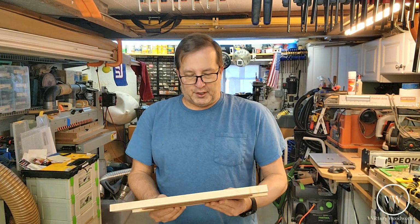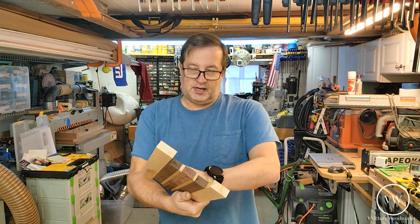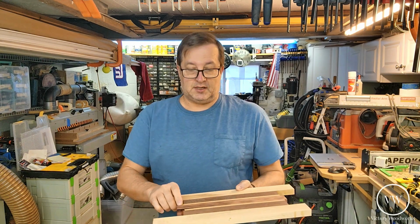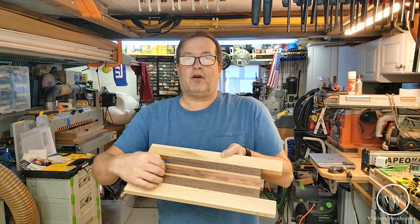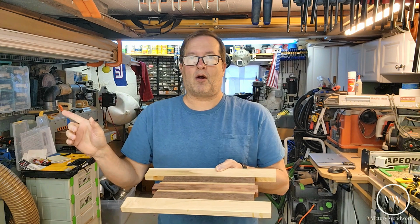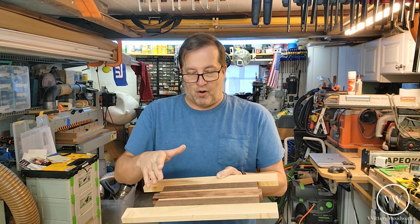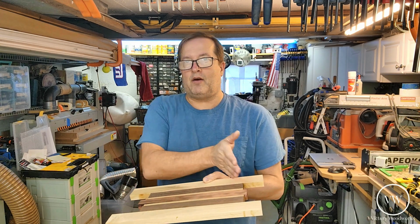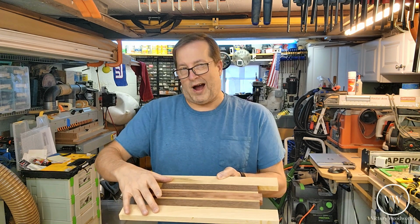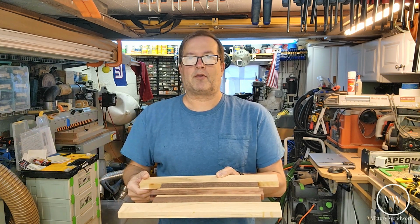So from a lumber preparation point of view, lumber's prepped. It's smoothed out, it's sanded to some level, and it's flat, ready for the CNC. But what we're going to do first is cut off these jagged edges to figure out the exact dimension we have. So when we go design in the Carbide Create application, we'll know exactly what we're working with. Our overall goal is to get the sides to be somewhere, I don't know, 5 inches tall by about 5.5 to 6 inches wide. I think I got the dimensions in the right direction. So stick with me, we're going to go to Carbide Create next.